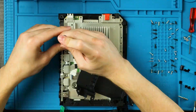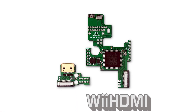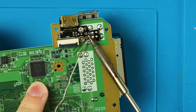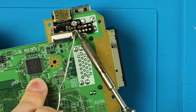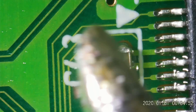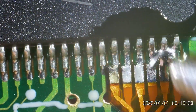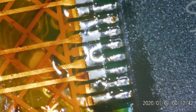Thankfully, even if you decide to keep your original shell, you still have to take this entire thing apart for this mod. Once you've done that, you need to split this board into two pieces exactly like this and solder the HDMI to these pins here. If you're wondering why my board looks used, it's because I already did this part on the first Wii that I got that wasn't the right revision. From there, we can remove the capacitor labeled C43 and solder the ribbon cable around the RVL chip here. Mine is singed because I had to take it off of the other motherboard once I realized my mistakes. This part was slightly difficult, mostly because I had trouble lining the pins up both times I attempted this, but it did end up being okay this time. Just take your time and make sure you don't bridge any of the pins.